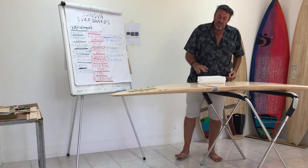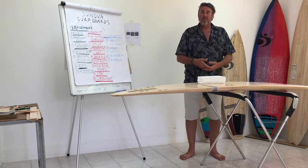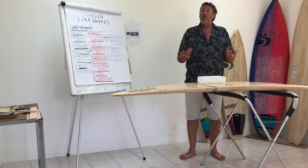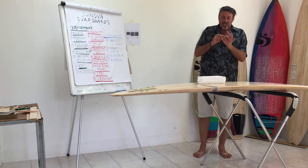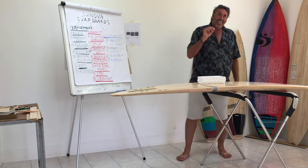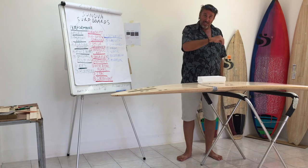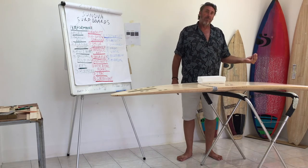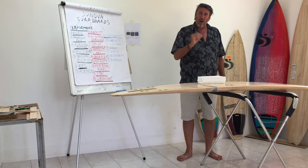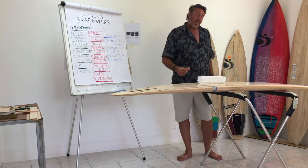When the board gets hot, the air inside wants to expand, and when it gets cold it wants to contract. The Gore-Tex is a fine membrane that allows air to go in and out constantly with the rise and fall in temperature, but it doesn't let water through. It's such a fine membrane that a water molecule is too large to pass, while an air molecule can sneak through.